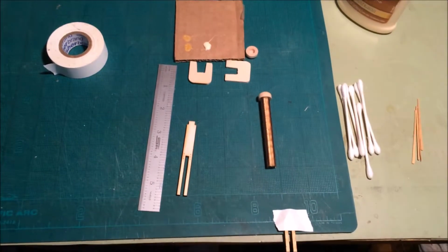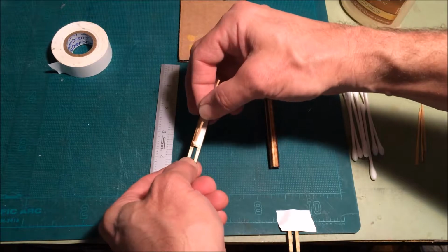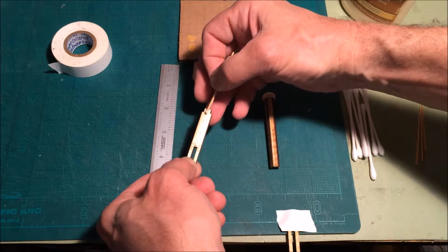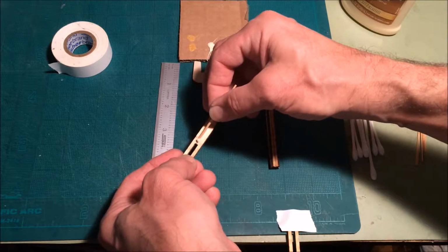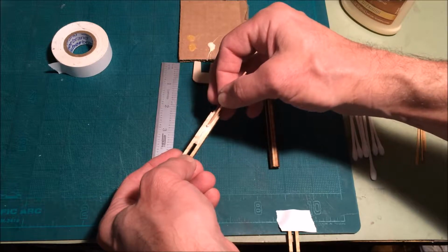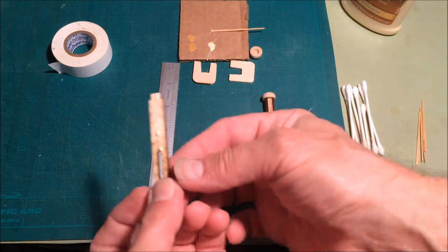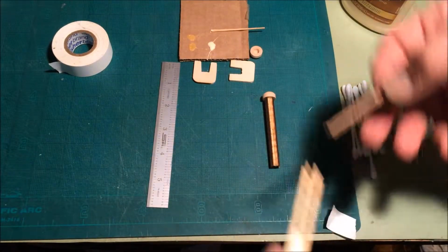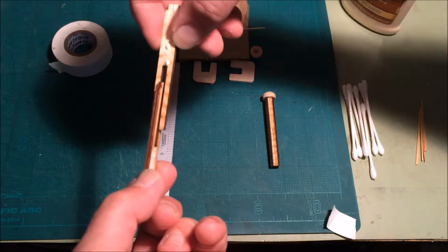I'm just taping it onto the side of the table while I grab the other piece and do the same thing. So I'm just going to put my glue, a couple of little dots down the middle. When you slide the two pieces together, the glue is going to get nicely slid, more or less spread out along that center line. And we don't really want too much extra glue that we have to deal with wiping up. So now we're just going to slide the two pieces together.